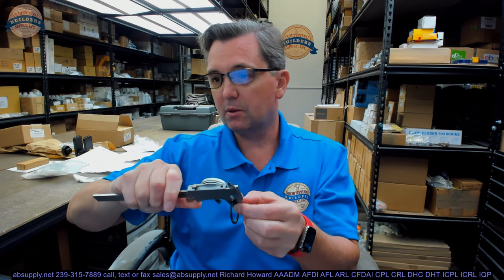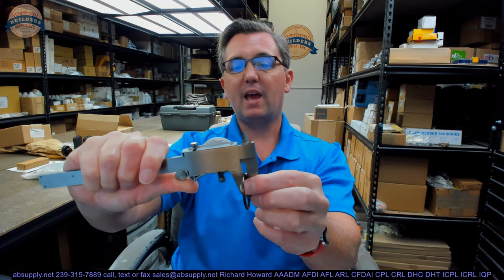This is the C, and the C specifically tells us that it is 3/32nds of an inch. My caliper tells me 0.094 — pretty close to 3/32nds of an inch.